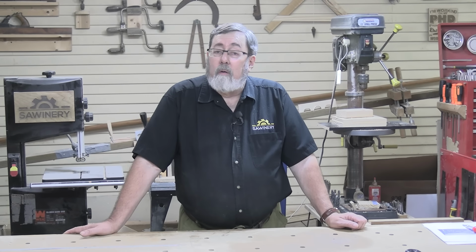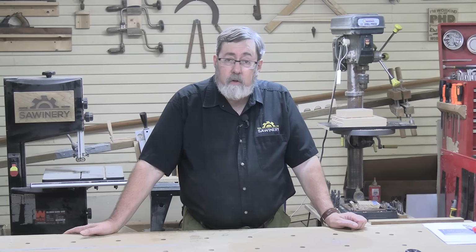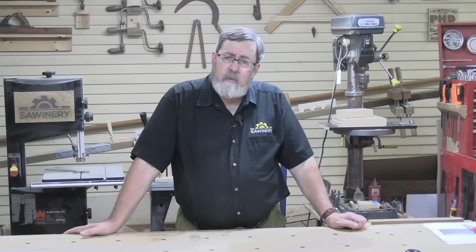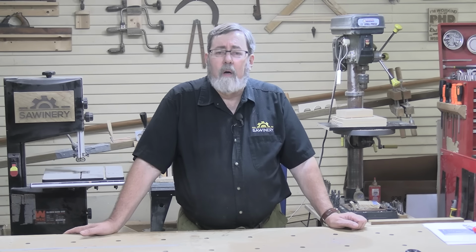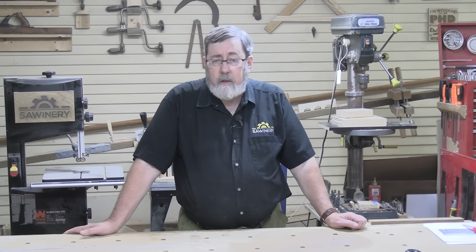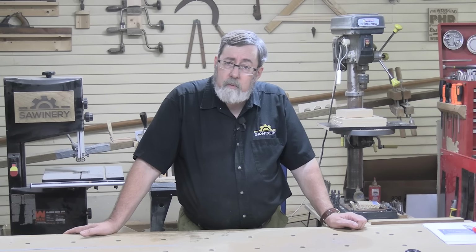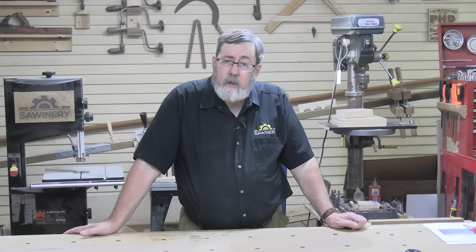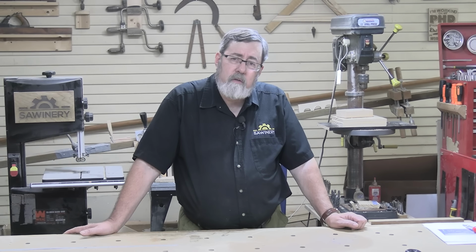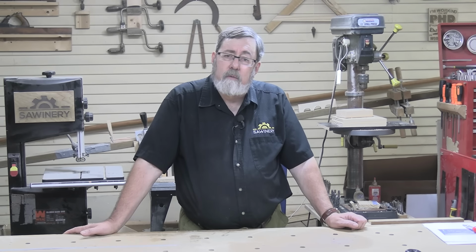Okay? So while the miter saw is a great tool, and there are a number of manufacturers that make some really good miter saws out there, I just don't think it's needed. I think the average woodworker can do everything they need to do with their table saw. Again, if you're going to do carpentry work, or even if you're going to do some remodeling work around the home, and you're going to be doing some heavy-duty trim work or architectural trim, yeah, get yourself a miter saw. But if you're just going to do one room, you can do everything you need to do as far as that architectural trim on your table saw. You don't need a miter saw.